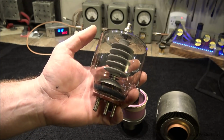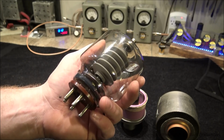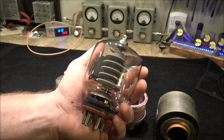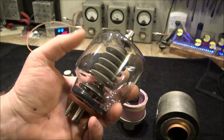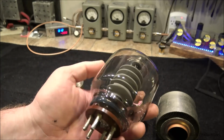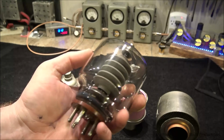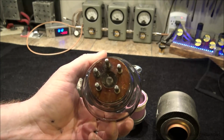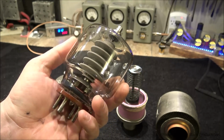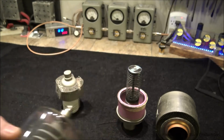And when we do that and we apply voltage to the filament, I call it the vacuum bottle test, or bottle test. Brand new 3500Z, stick it in a socket, light it up, sit there and watch it for a few minutes. If there's any bits of little oxygen inside here, they'll immediately oxidize on the filament, cause the filament to break down, and it'll fill up with smoke. That's what happened here. That's a particular outcome for this tube. That, and it was really, really low on gain. So when this thing opened up, one of the pins lost its vacuum at the bottom, and some air got in it. When it opened up, it wasn't a surprise.